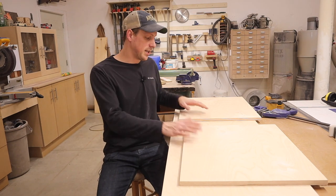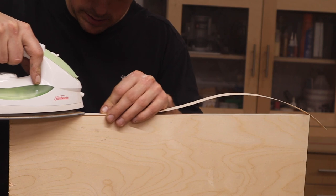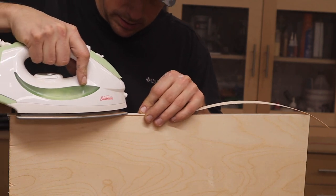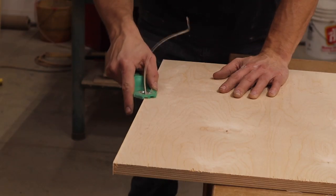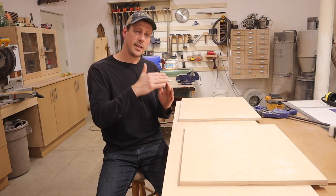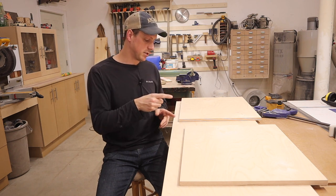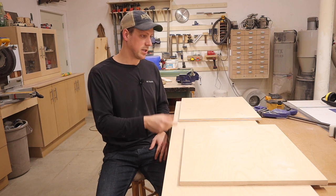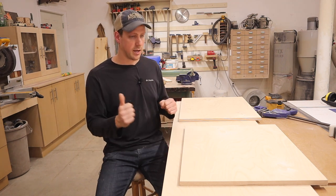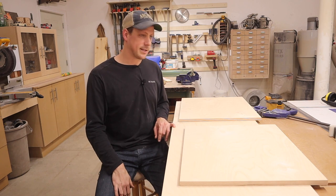I cut the sides, and the piece underneath will be the top and bottom. I added edge banding so we won't see the edge of the plywood — it'll look nice and clean when finished. For the top and sides I want a miter joint where they meet, so I'll cut that on the table saw. I'll cut it, flip it around, and what comes off will be the piece for the bottom.